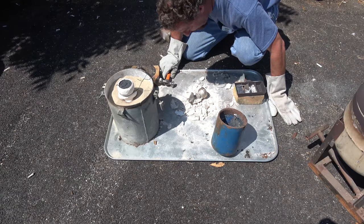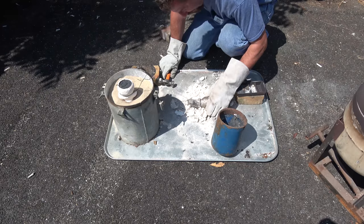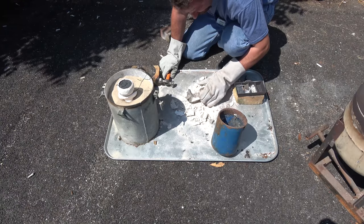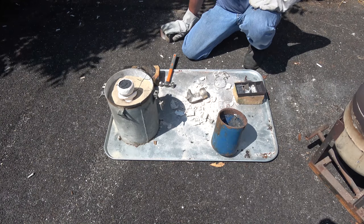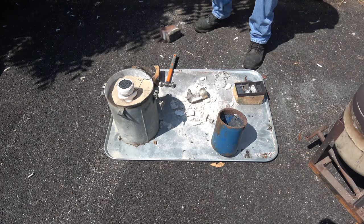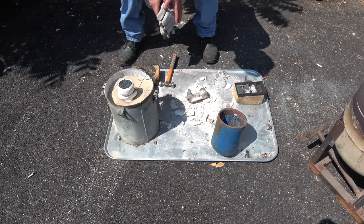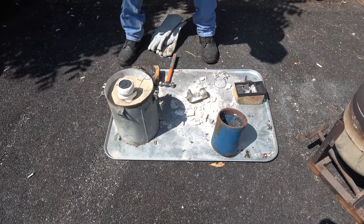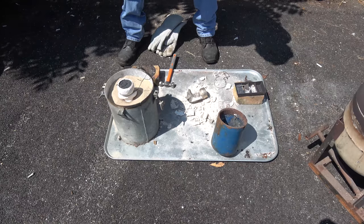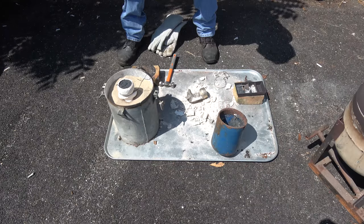Finish looks pretty good on it. Finish chiseling them out of there and get them cleaned up a bit. Yeah, they look okay sitting up on the mantle. No complaints. Next time I'll definitely increase the size of the vents coming off the ears. When you do investment block casting and you're using vacuum, you don't generally have problems like that. So this is still just a little bit of a learning curve, but not too bad.